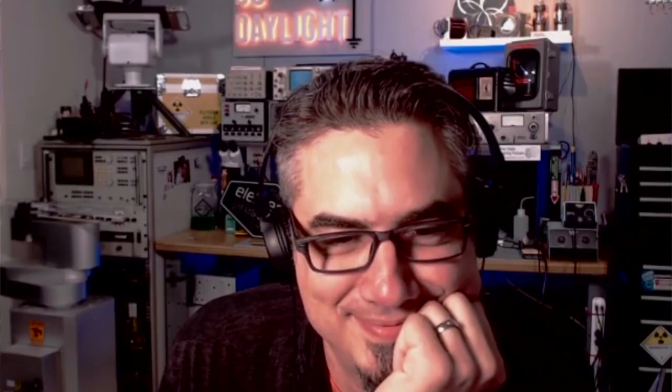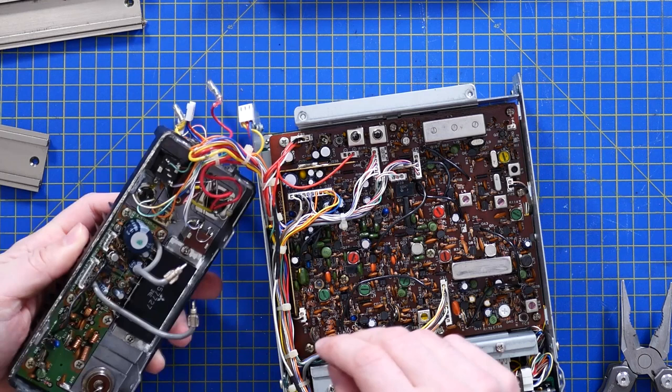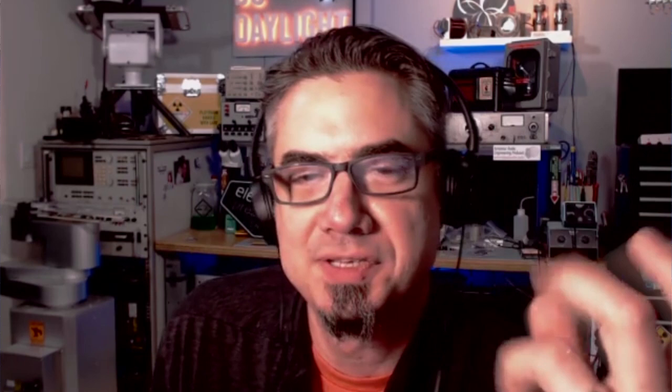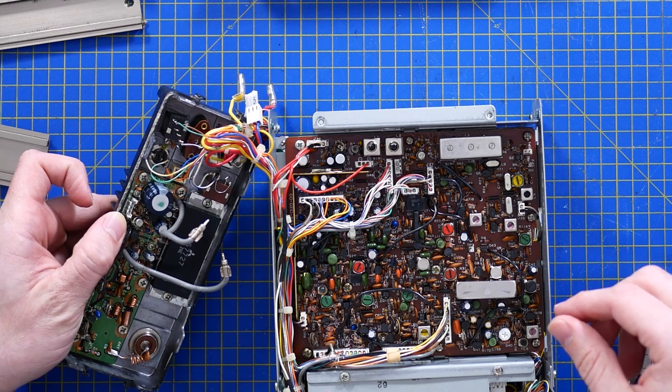External speaker is a 3.5mm jack. The standby connection looks like a 2.5mm jack. And then you've got the auxiliary, which honestly looks like an old connector you would use on audio equipment in the 1950s. That's probably for an external amplifier. So when you're in SSB mode, if you're not talking, there's no RF coming out of the radio. So if you connect that to an amplifier, the amplifier doesn't know when you're transmitting if you're not speaking. You can actually use that to trigger your amplifier to turn it on when you hold the key down on your handset. And there's also what's called an ALC — so the amplifier, if you're driving it too hard, can talk back and control the radio's output power through that connector.